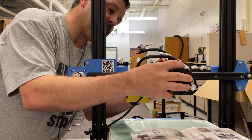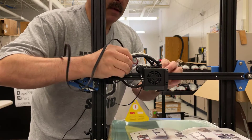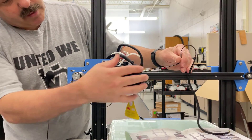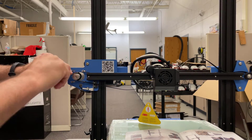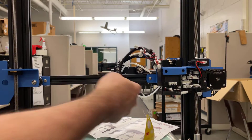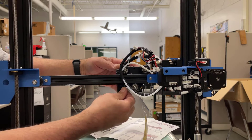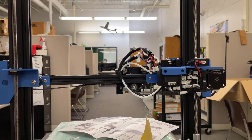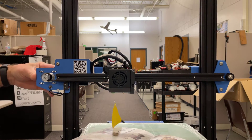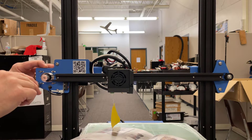It just hooks in the metal bracket. Slide this one through underneath. Notice I was able to roll the hot end to get a better grip on this little piece. I'm going to loosen these so I can have a little bit of extra play — you can see that it slides. With that loose, we can bring this through, feed it around, making sure the clips are down. Notice both clips are down, and you can put that right back in place. Now grab that little Allen wrench and we can adjust our belt tension to where we like it, then quickly tighten it in. That's how easy it is to get your belt the way you want it.